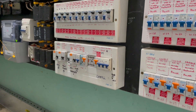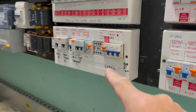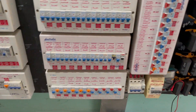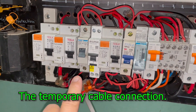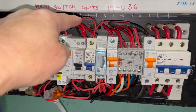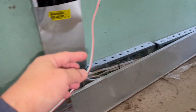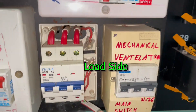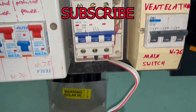Let's run some cables and see if we can relocate this circuit breaker to another spot. This is what I have done: I installed a new circuit breaker — that's my input power, 240 volts — and that wire goes to the cable that will go to the main fire panel. This is only temporary.